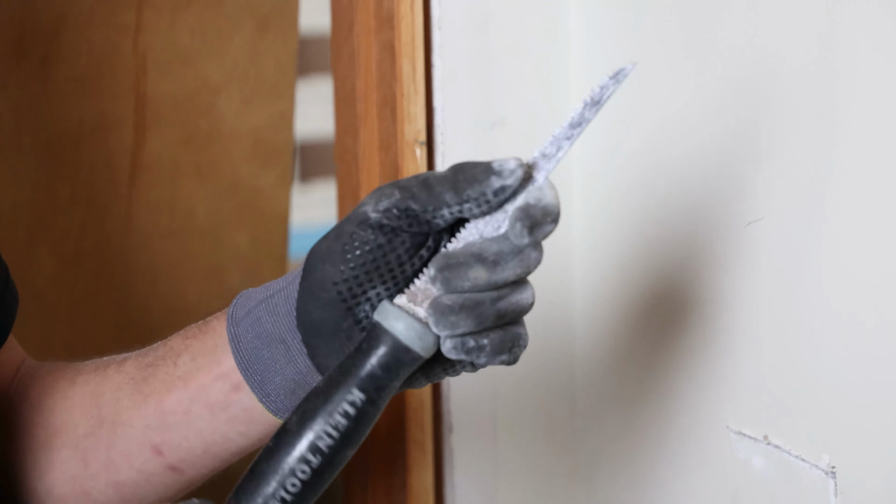That's pretty light. So if I'm here and I need to pull that back through on the finish out, I'm just gonna yank that, wire nut's gonna pop off, and I'll have the end of the wire. So that is a provision right there I don't think I will need. But 12 inches of wire is about 50 cents. That's a healthy loop right there. No more, no less. I'm gonna put a light staple right there. Again, I want that staple to pop out if I need it to. If I need that slack, if something changes, if I end up in the next bay over from what was anticipated and laid out with the homeowner.